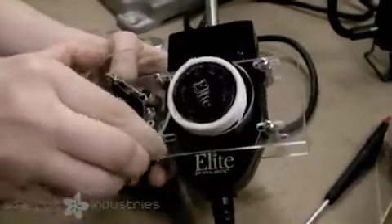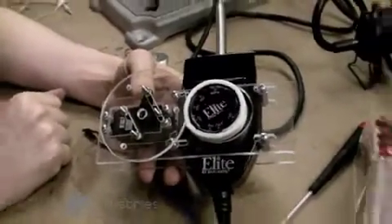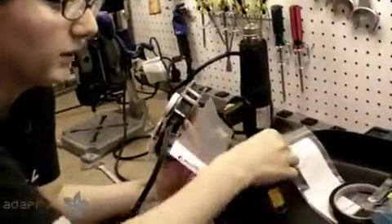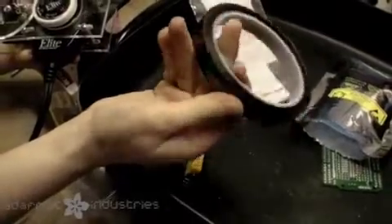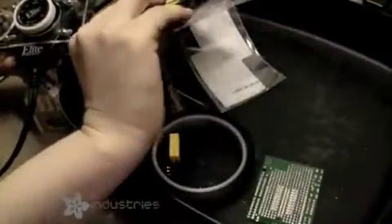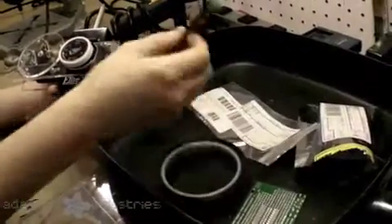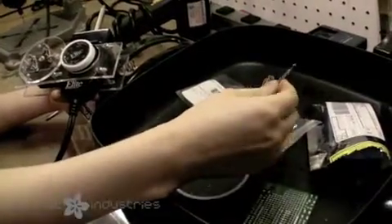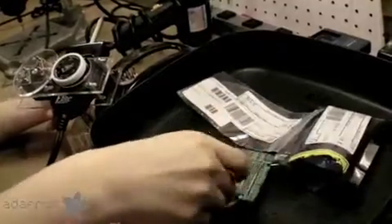This is basically a temperature controller, and I'm taking advantage of the one inside here already and using a servo instead. Then you're going to put things in the skillet to heat them up. Yeah, so this is kind of all my parts. I'm going to have a temperature sensor, and here's some Kapton tape — this is a high temperature tape. This is just a circuit board, and I've got a little chip here that I got from Digi-Key, and it will be able to control this sensor. This is how I'm going to connect it to my Arduino when I do the Arduino code.